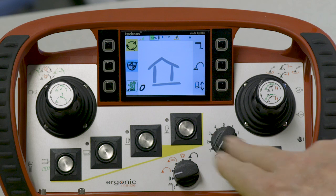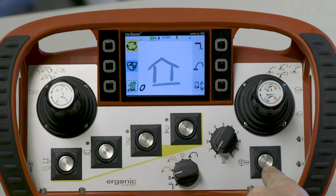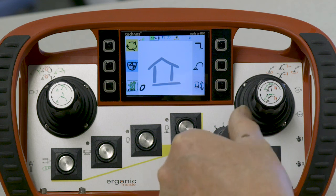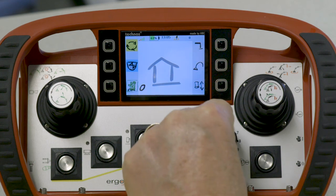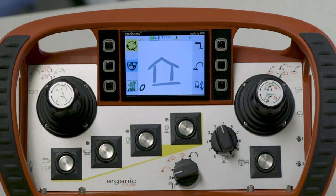The mechanical switches are flush for ease of cleaning and operation, and they have LEDs that light up to show that they are activated. In the bottom right, this is our e-stop reset button, and there is a sequence to push this button to start the remote and to clear the e-stop. Next, we have our pump volume control dial, which measures the pump output speed and selects it from zero to 10, or 0 to 100 percent output. So the operator has the ability to choose the output speed of the concrete pump right from the remote.